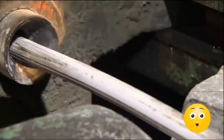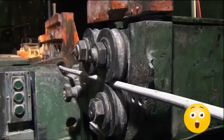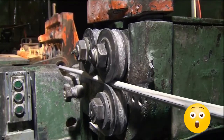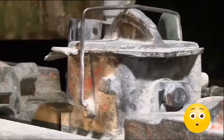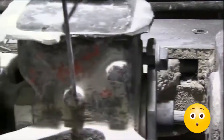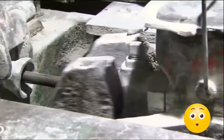First, the wire has to be pulled perfectly straight, because if there's even a little kink in the steel, it could turn into a weakness in the bolts. To work out the kinks, the wire is tugged through a set of rollers to roll out the bigger bends and waves. A second machine yanks the wire through a tiny hole, or die, that's slightly smaller in diameter than the wire. The force of squeezing through the narrow die makes the wire straight and smooth. The tight squeeze also wears away the lubricant and reduces the diameter of the wire to exactly three-quarters of an inch.